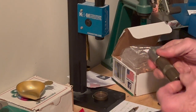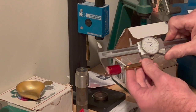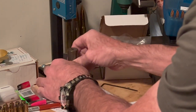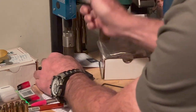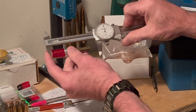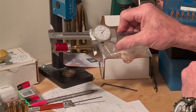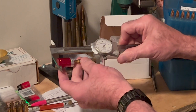I felt it go in just a little bit. Put it on the caliper — we're at 2 inch 9.15. Let's try it again. That's where I want to be — 2 inch 9.13. So that's giving me 22 thousandths off the original length, which was 2 inch 9.35. I like that one, so we're going to go with that.